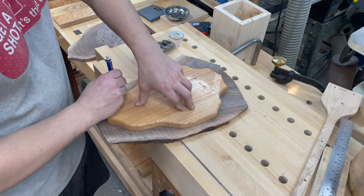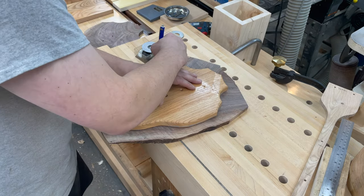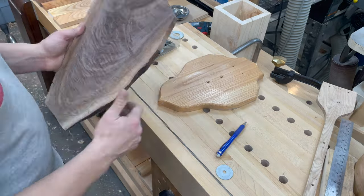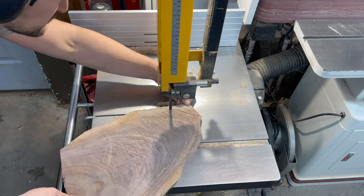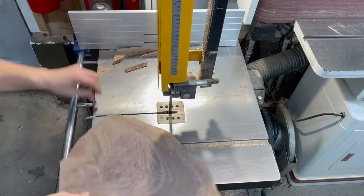In order to make a larger plaque for the larger skull, I'm going to use this time-tested woodworking trick. Taking a washer from the parts drawer and a pencil, I can make a larger tracing. Now you will notice that it tends to round over the corners, so I will need to be careful at the bandsaw to leave some sharp corners and not follow my tracing exactly.